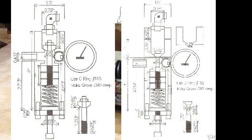I've got 200 psi in the tank, and it takes about 140 psi for the piston to close the stopper enough to stop it from seeping or leaking air. So right now it works pretty good. It's adjustable, and I'm running pressure anyway between like 150 and 200 psi in the air motor, so I think that will work okay.